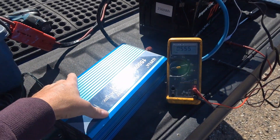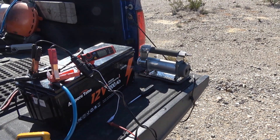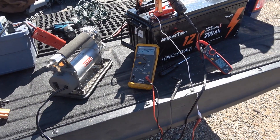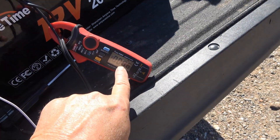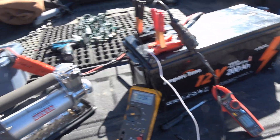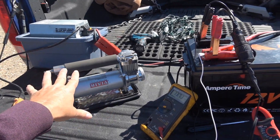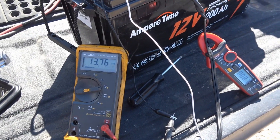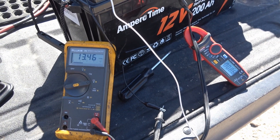To get the inverter out of the question, I have a 12 volt tire pump — a 12 volt compressor — and we'll do a test with it. I've hooked up the 12 volt air compressor and turned it on. It reads 13.3 volts and the compressor draws 8.6 amps, so the battery is working fine. Now I'm going to turn on the charger. The charger is charging the battery while the battery is supplying DC to power the compressor. Now watch what happens when I turn off and unplug the charger. You can see that voltage drop there.